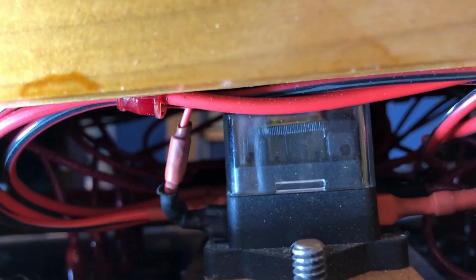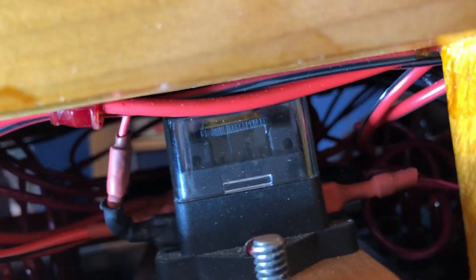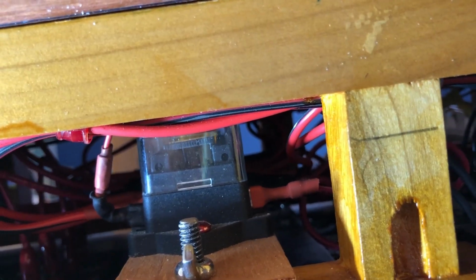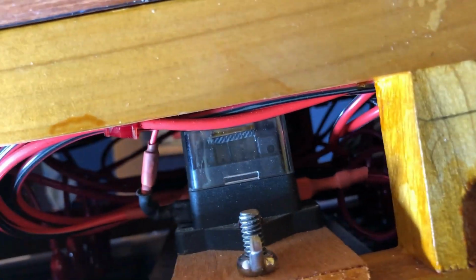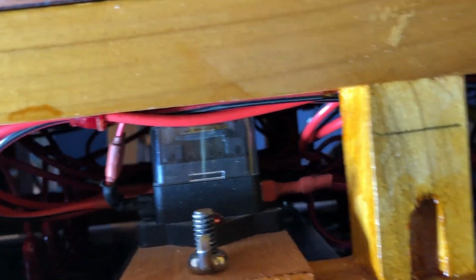And you can see a kind of a plastic cover right there. Those are the fuses, the main fuses, and each battery cell holder has its own fuse. So that if for some reason a cell holder shorts out and it blows the fuse, all the other cells will still be connected and be good, so they'll get isolated.